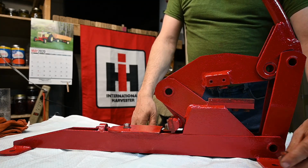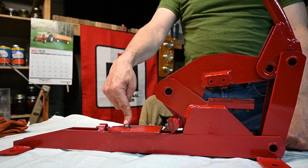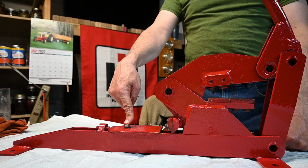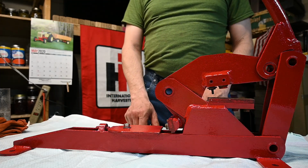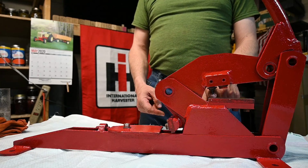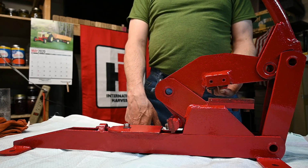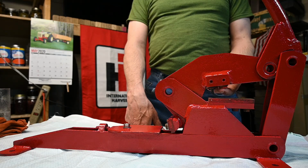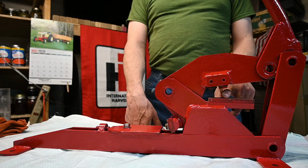So in a future video I'll show actually how this sickle servicer works, and I'll do a complete blade, and we'll go through the process of how to break the old blade out, break the rivets out, push through the rivets that are being stubborn, and then we'll seat. This also seats the rivets into the blade. That's what this part over here does. It will actually crimp the rivets right into the blade.